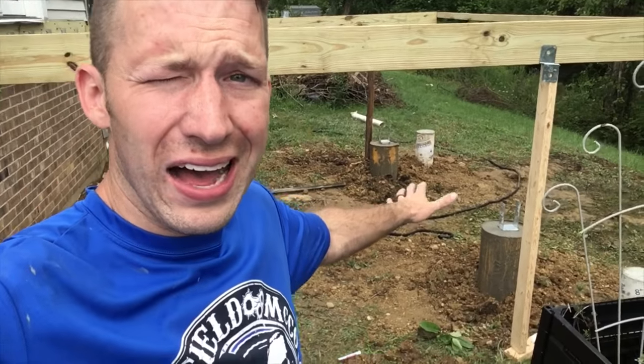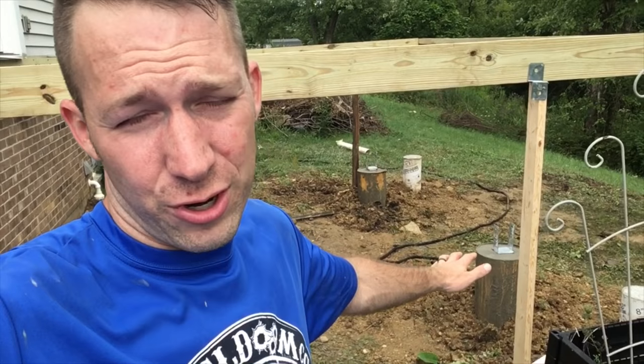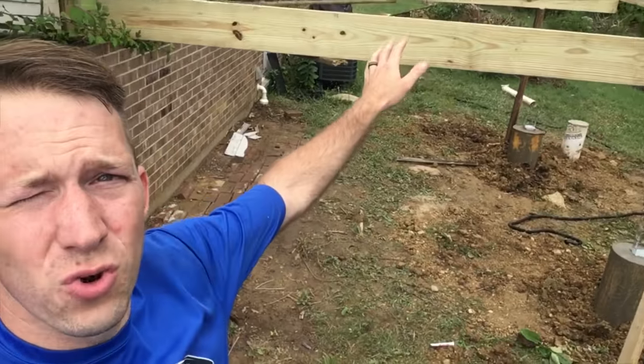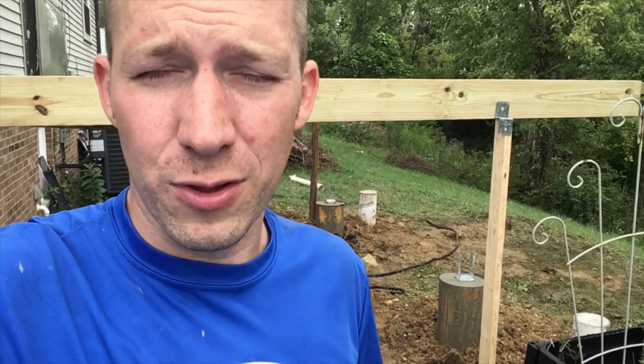That is how I took care of these footers for this particular situation. You can see the hill — there's a creek down there — so I had to take a lot of considerations with these particular footers. Still a lot of work ahead with this deck: we still have to put all of the joists into the frame, all the deck boards across, do the railing and a staircase. I've seen many different opinions on what kind of concrete to use, how much, whether to use rebar, whether to use gravel at the bottom. Pretty much anybody's opinion is the right one — I'm just showing you how I did it. If you're a professional and want to chime in with the right way, love to see your comments below. Hit subscribe and turn on your notifications for more updates from Spirit of a Handyman.